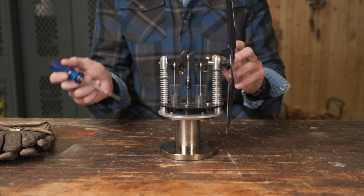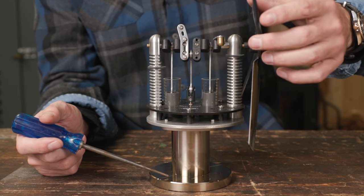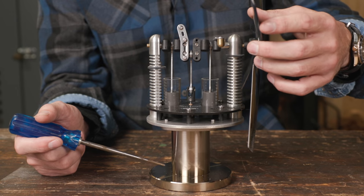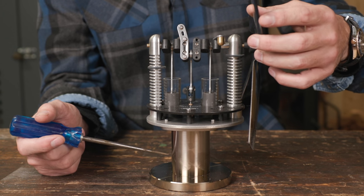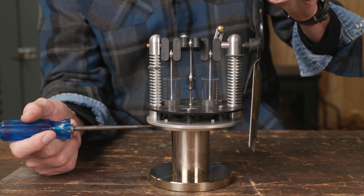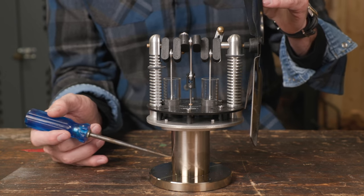Here's how it works: in the down position, imagine that hockey puck down there. The base is being heated by the wood stove — there's a temperature differentiation. We know that as air is heated, it expands. As the air expands, it starts to push past the displacer, pushing this piston up. And then as that pushes up, we've got a temperature variation and the pressure is being lowered.